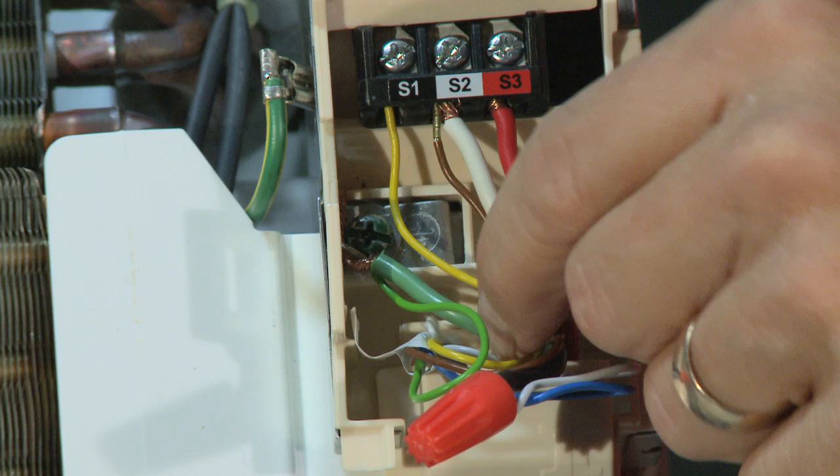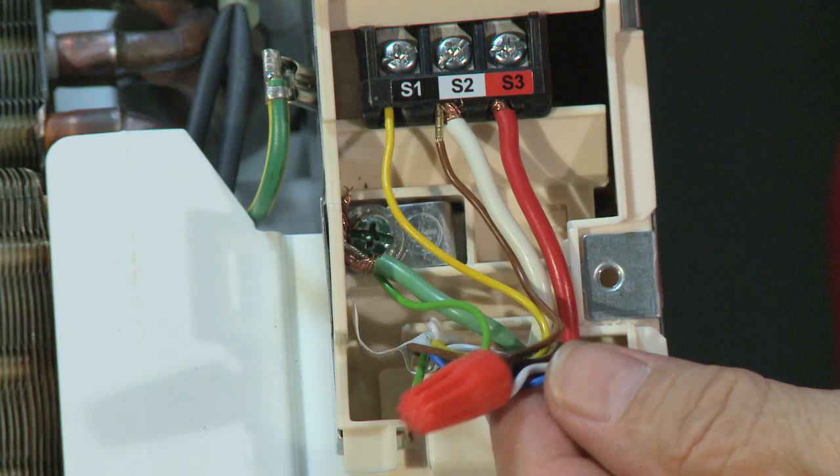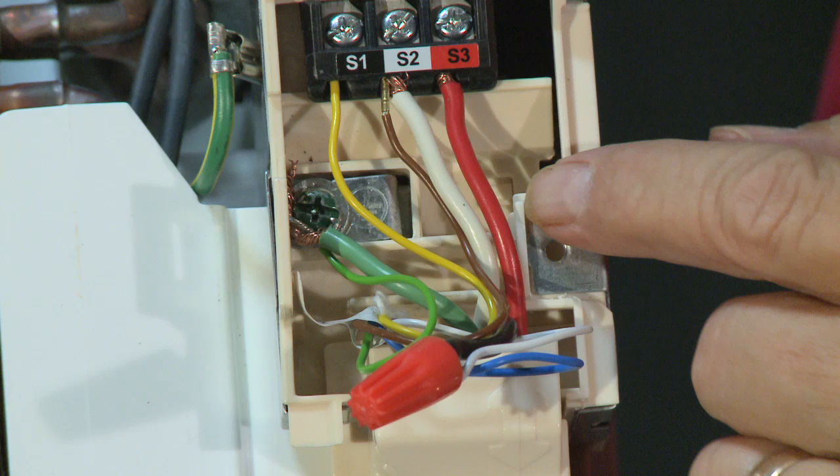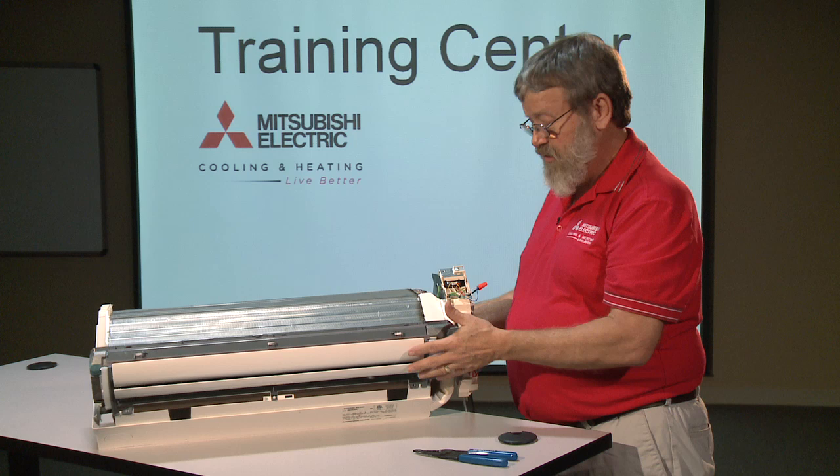Double-checking our wires: S1 is on the contact through your normally closed contact, being powered by S1 from outdoor. S2 from outdoor and your brown wire for your pump. Your pump is now wired up and ready to go — S3 is not broken, you're only breaking S1.